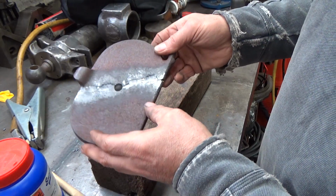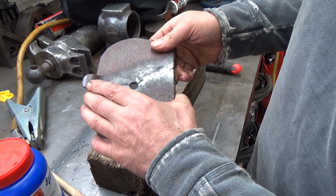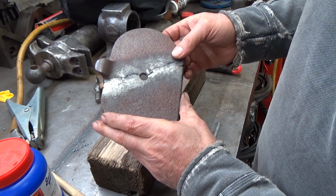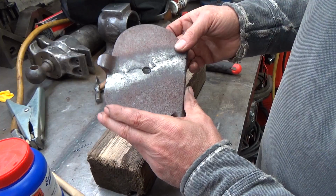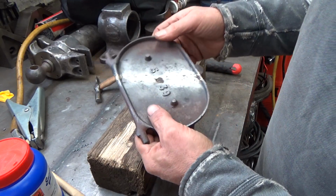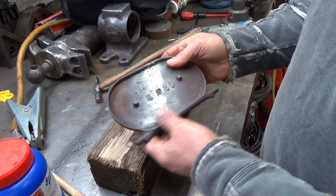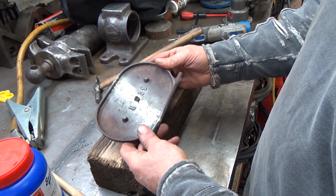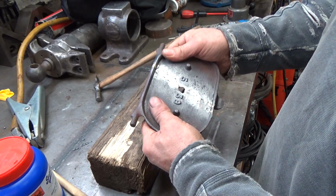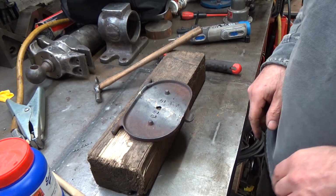Is that a bit of penetration there? There's a drip. That is. That's obviously worked. You know, I'd expect to see a bit more brass on this rear side if I'd been using oxyacetylene. I mean, so that's a solid repair. I can tidy this up, but it's more about physical strength and durability. Is it? Maybe it's just about getting it done.